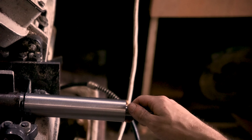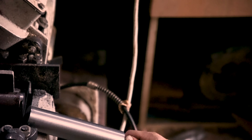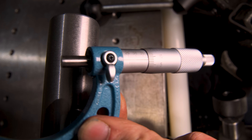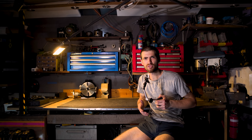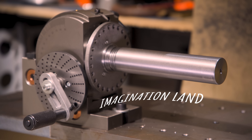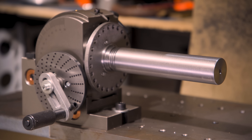The surface finish came out absolutely fantastic for a mild steel part. It is turning a very slight taper even on the bits that are meant to be straight — but that's more to do with the fact that I haven't levelled the bed, because every time I try to import a precision level it gets denied at customs. Once I mill some flats, bore some holes, and cut taps and threads, I'll be able to run multiple parts accessing almost all of the features in a single setup. We'll make a production machine out of this thing yet.